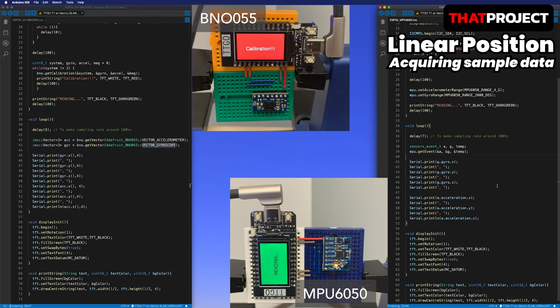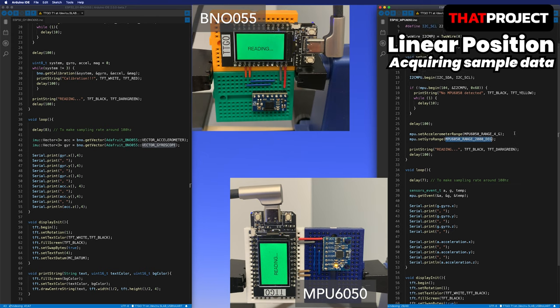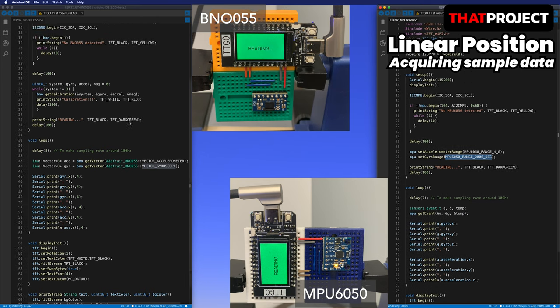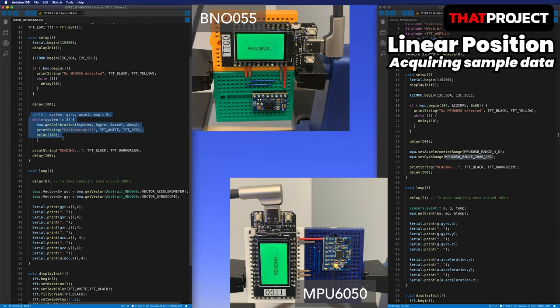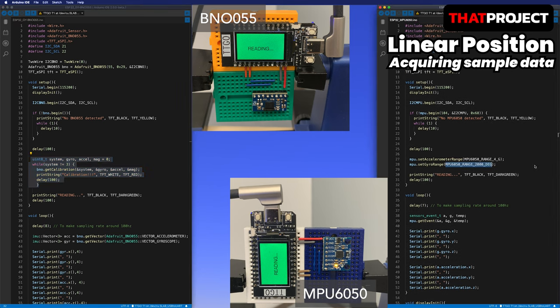Both use the library provided by Adafruit. It was good that there was no part for calibration in MPU6050. I tested with the raw readings as much as possible before using another code with calibration. I will also test with other libraries that have Bayesian noise filtering in the next video. Both accelerometers' range is 4G and the gyroscope's range is set to 2000 degrees. To make the sampling rate closest to 100 Hz, I put a delay in the loop. When you acquire 10,000 samples, you will get a 99 Hz sampling rate if you use the same hardware.